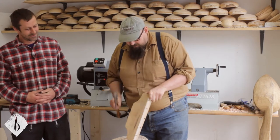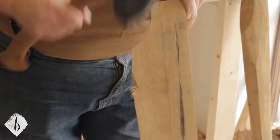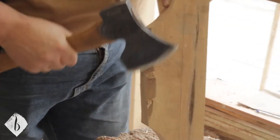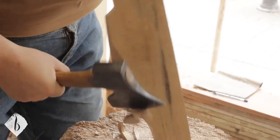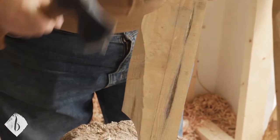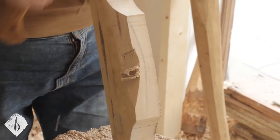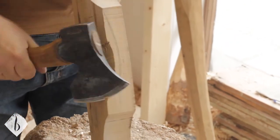Axing seasoned elm is definitely a thing. I'm going to start axing the top here — this is the bit that in theory I don't have to be quite so careful with. This is putting on our 10 degree slight lean back on the crest, and that angle is much more comfortable for your lumbar support. If this was a cleft bit of wood I'd really confidently be able to just axe away, but it's not feeling nice with this sawn piece.